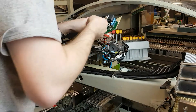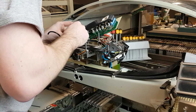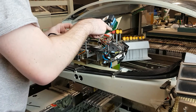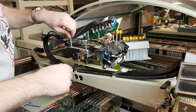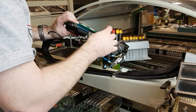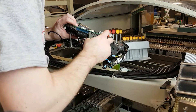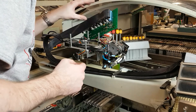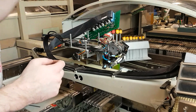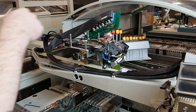Looking at the bottom of this board, one of the ceramic caps has had a bad day. And this connector on the end here — darkened. The board underneath it looks like it's had a lot of current running through. Oh, it's resistors. The resistors next to X21 have also had a bad day. They've darkened that board quite a lot. I wonder if they're deceleration resistors or something, because that section of the board there is really quite dark.